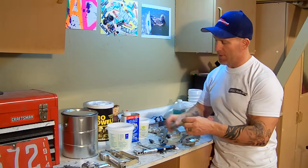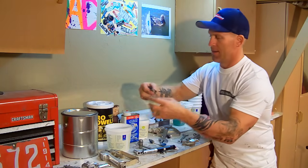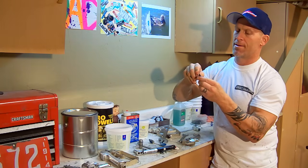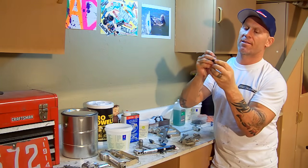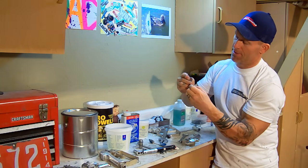So I got that one O-ring there I'm going to take off, and then on the packings right here, I've got another O-ring right here. It's right inside there. That's where these little tiny eyeglass screwdrivers work to help get those O-rings off.